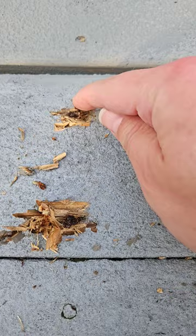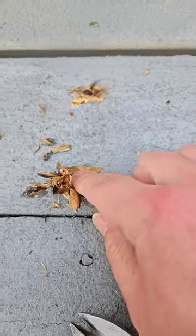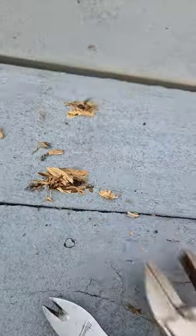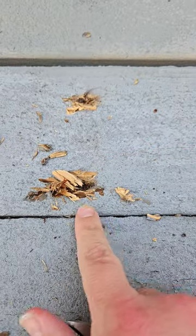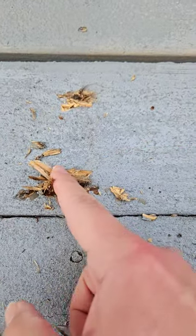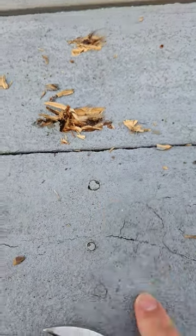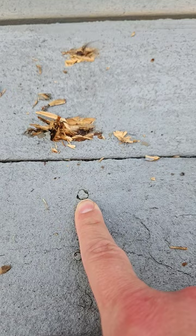You have to chew all the wood away to get to it with like a cat's paw. And then you can either use some vice grips, as I've shown, to pull them out. Yes, you can put a cordless drill around the head, but the amount of labor to actually get at that screw head if it's inset into the deck — versus getting a nail like this out, which is about a hundred times easier.